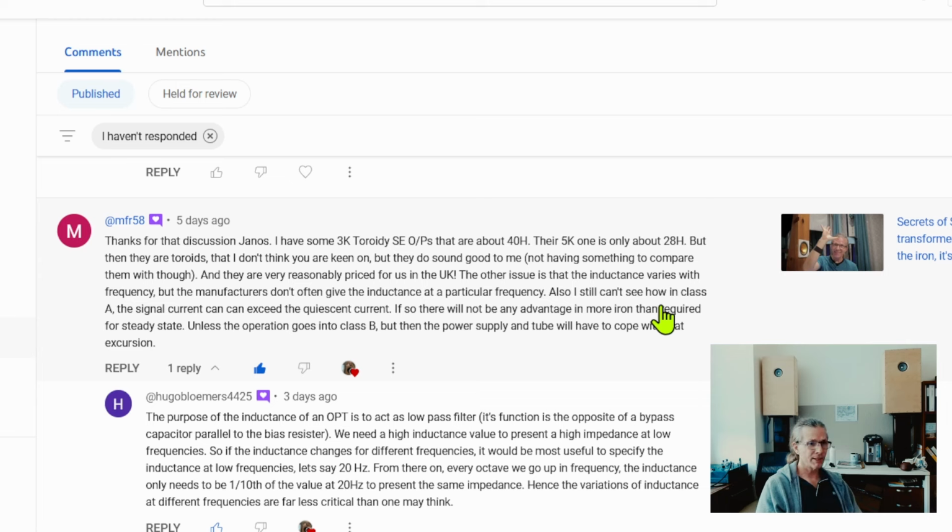And that's why often when I hear amplifiers with toroids at people's homes, sometimes they sound as if there's no power in them, they just sound puny and without any kind of slam, because they got saturated.